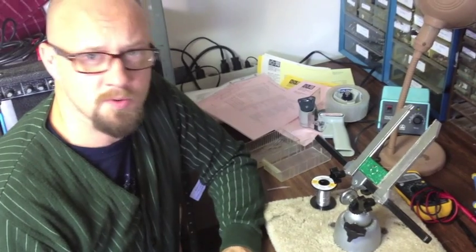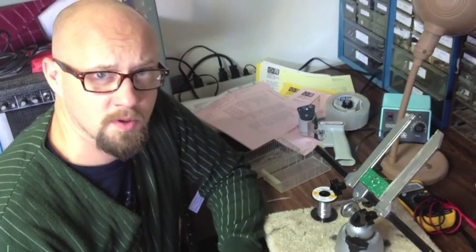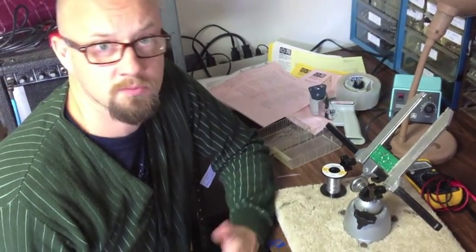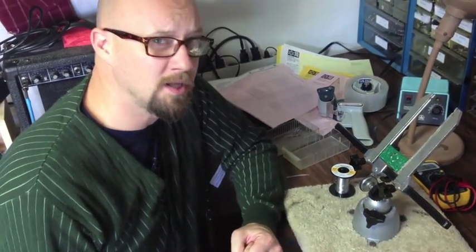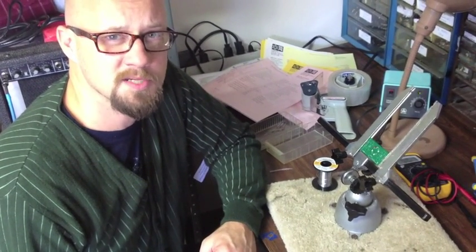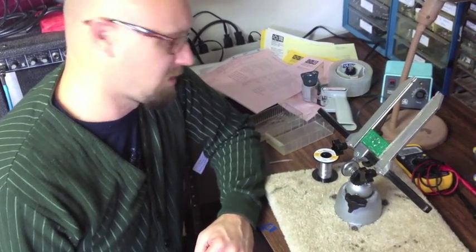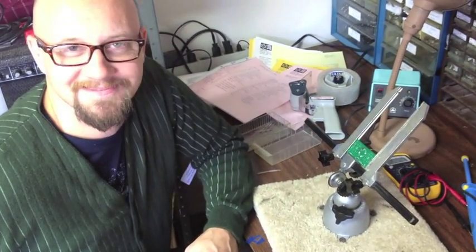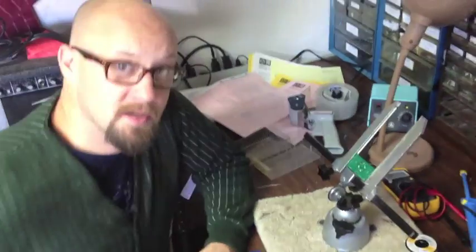Also make sure that your surface is nice and shiny. If it's dull, you'll most likely have a cold solder joint, which can break off the board later or not ensure a good connection, leading to a lot of problems. If you're putting a lot of solder on there, you've probably done too much — try to use as little as you possibly can. I don't always wear ventilation protection, but it's a good idea, and so is eye protection. Thanks for watching — we're going to have more tips on how to solder.